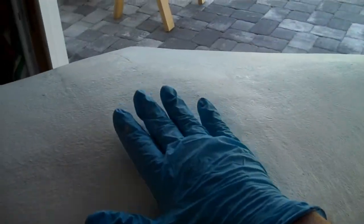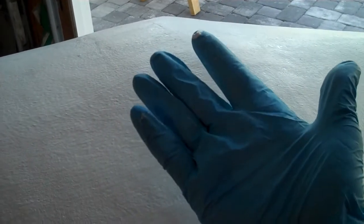Last time I used 1.5% hardener and a thin layer didn't dry for a week. This time I moved up to 3% hardener, and the stuff I got down in a thin coat is just slightly tacky — it's not coming off on the glove — after only about 20 hours, which is acceptable performance on a cure time. Unfortunately, because I used too much, it started to harden up in my paint tray. This was the absolute last batch I was doing and I didn't have any more, so instead of throwing it out I hit it with my roller as fast as I could.